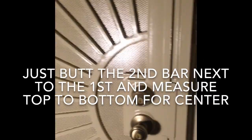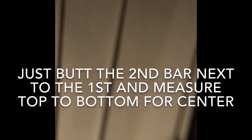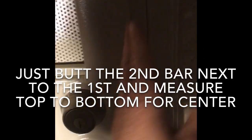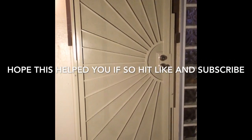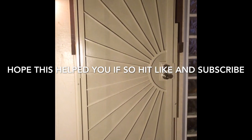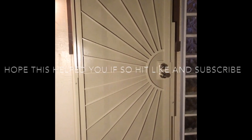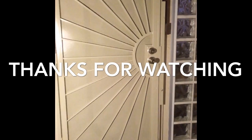All done - works great, the deadbolt works, everything's nice. As you can see, that bar I put here - it's supposed to go up top but I've never put it there because somebody can get a crowbar in there and pry it away. This just adds an extra layer of difficulty. Instead of three screws and a single bar, you're prying away five screws and a double bar. It doesn't look bad at all - totally natural in that position. Instead of a little bit of trim up top, you've got extra security on the door handle. Later, have a good one.